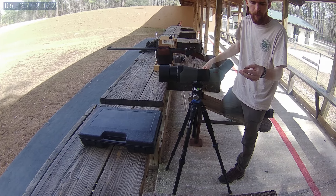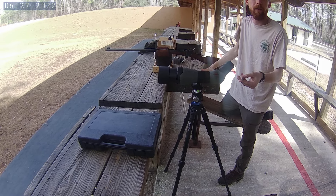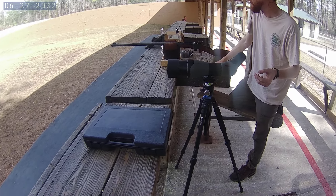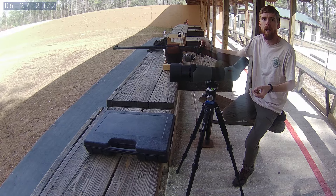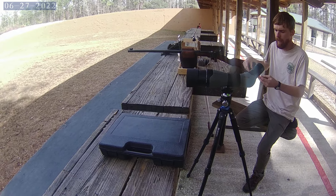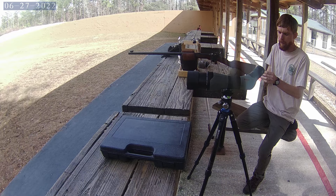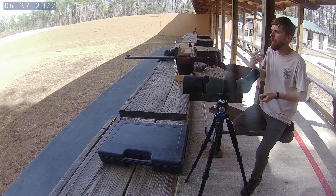Smokeless rounds are about two to three dollars a piece. Can you shoot smokeless through that? Yes, but when you shoot smokeless you have to reduce the loads due to the falling block mechanism — it can't withstand the same pressures as modern rifles. With black powder you can fill the cartridge basically all the way up and compress it a little, but smokeless burns at a different rate.